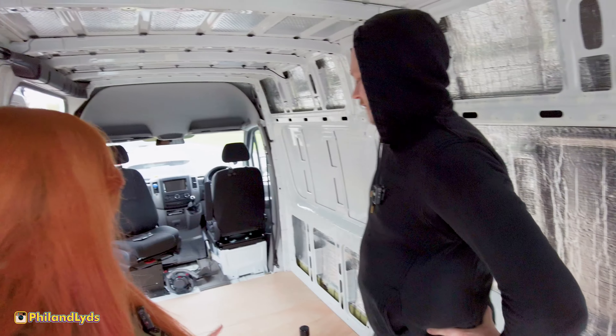It's laid, it's glued, and it's weighed down by the heaviest objects we own. Fingers crossed it'll be flat when we come back tomorrow — flat enough that we can just file off an edge if needed. We came back and finished off the silicone around the edges, and the floor is done! It looks so good, finally — this has been a long time coming. Definitely tracing the old floor worked best; the cardboard template wasn't quite right.